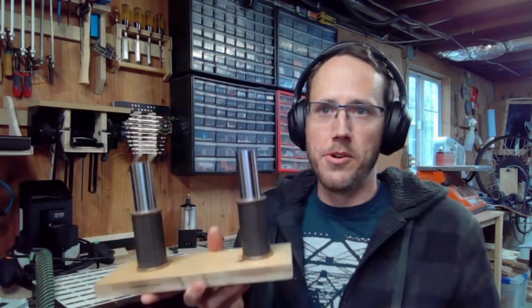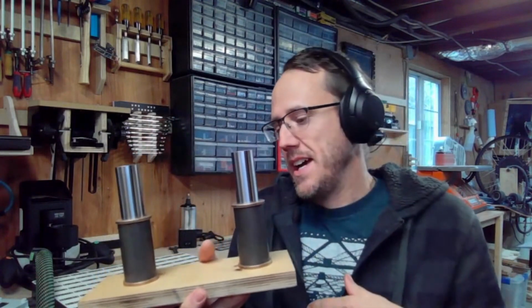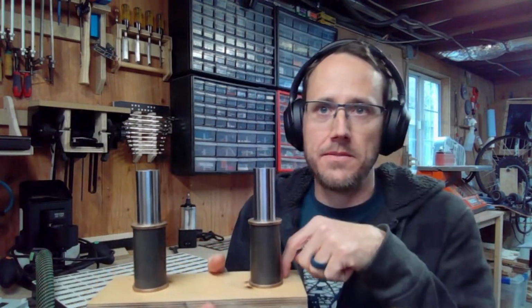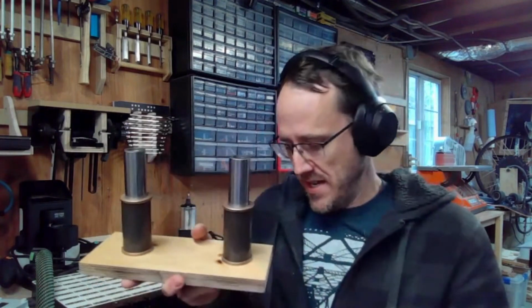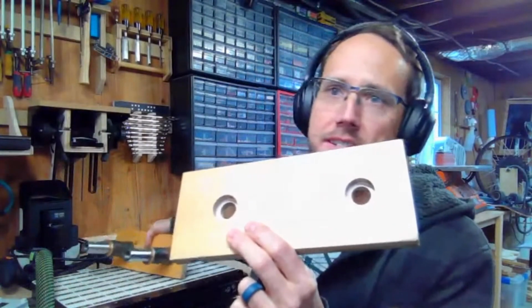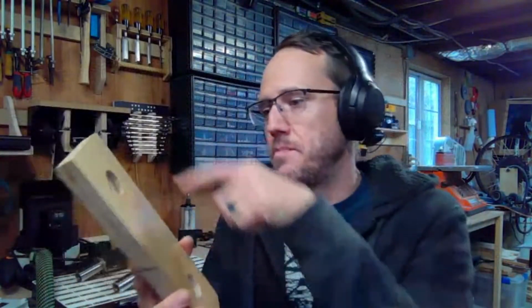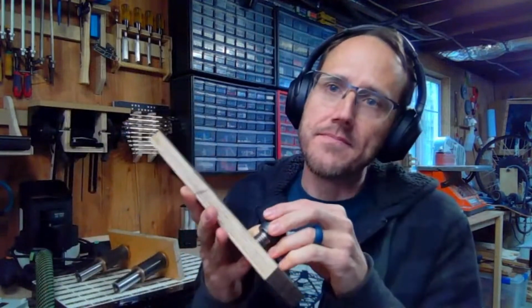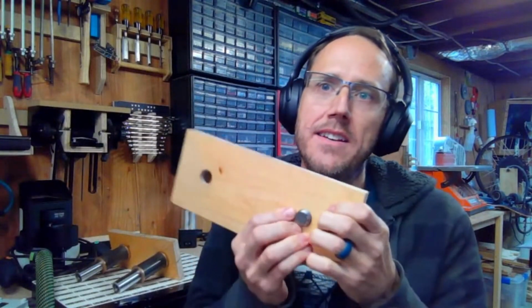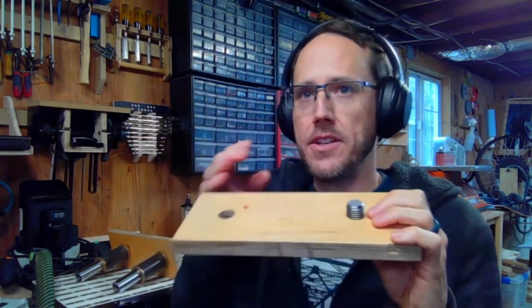But the fastest and best solution I could come up with for him was to grab Origin, a 3/4 inch piece of plywood, and on-tool CAD. And within about 20 minutes, I was able to place these two holes that we had to make that mount a counterbore screw on a piece of wood accurately to 6 inches apart and cut them out. So I didn't have to go to a computer. I probably just centered them on this piece of wood with the grid. I measured the bolt that needs to go in there and cut those bores to fit nice and tight. So we could repeatedly weld up a few of these things and have good equal spacing.